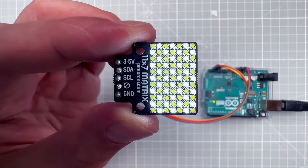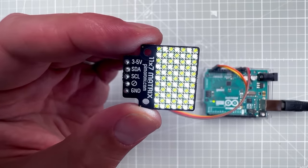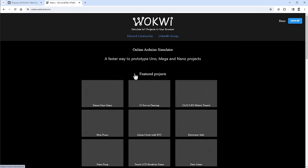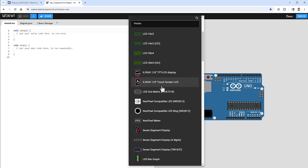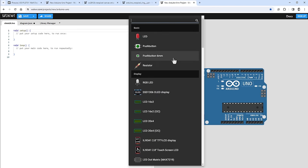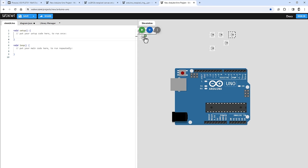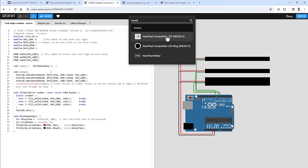Before creating a custom picture I want to simulate the display so I don't have to upload a new sketch with every change. I want real-time feedback. I use Wokwi, a free online Arduino emulator that supports Arduino Uno and many components. Unfortunately the Pimoroni display isn't available, and while there's an LED dot matrix display it doesn't support grayscale — but the NeoPixel LED does support grayscale, and there's a special component called the NeoPixel canvas.